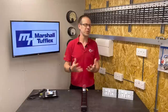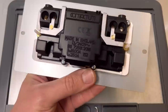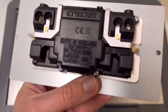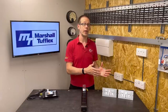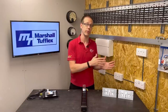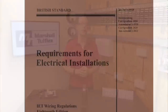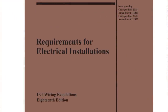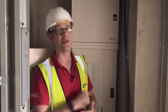So what changed? Basically there was some ambiguous wording in BS 7288 that stated if this type of socket was used on an installation then additional protection is required in the circuit feeding it. This made it unclear whether BS 7288 ensured that this type of socket outlet would protect a person's life in the event of them getting a shock to earth. Really I think it was just stating that the RCD technology in here wouldn't provide additional protection to someone drilling through the cable supplying the socket outlet, but it was enough to prevent it being included in the older version of the 18th edition. Fortunately the wording has now been modified in BS 7288 — funnily enough around the same time the second amendment to the 18th edition was launched — and it could now be included in the list of approved RCD types. So there we go, we now know where the RCD protection needs to go depending on the installation circumstances.